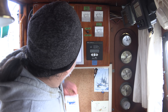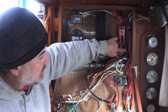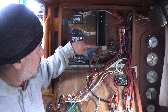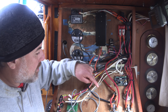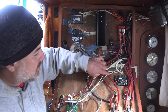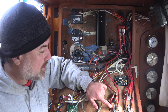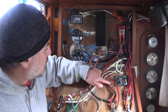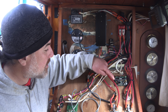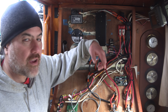Let's take a look under the hood. These are the 12-volt cables coming from the D400 — the red positive cable and the black negative cable. The black negative cable goes to this power post where it connects to the negative cable coming from the regulator and to the braking switch. The red positive cable goes to this 50-amp fuse and then continues on to the amp meter that shows the total number of amps coming from the D400. From the amp meter it goes to the braking switch, where it continues on to the red cable coming from the regulator. If the braking switch is in the on position, it connects the positive cable from the D400 to the negative cable, shorting out the D400.